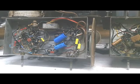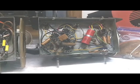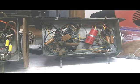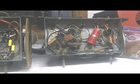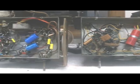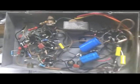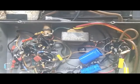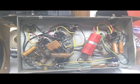I just opened up Coke radio number 2. That's this one here on the right. And I noticed immediately some design changes. I thought all these radios were built in the same year, and they may have been, but they definitely made some changes along the way. This is the first radio we worked on. You'll notice it's got the audio output transformer underneath the chassis. This one, the audio output transformer is mounted on top of the speaker on the other side. I'll show you that in a second.